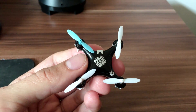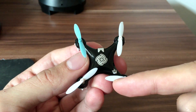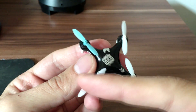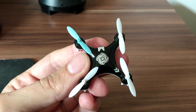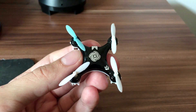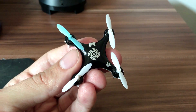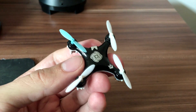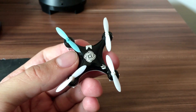The second important thing to know is that B propeller motors spin in the clockwise direction, and A propeller motors spin in the counterclockwise direction. When ordering replacement motors, you need to know which motor is not working. There is always an option to use a motor with the opposite direction, but then you need to wire it differently and the motor life will be a lot shorter.